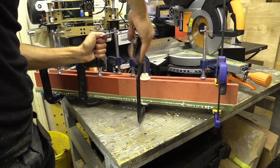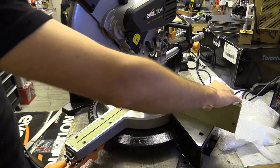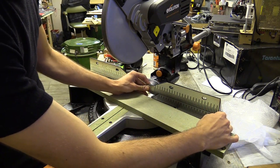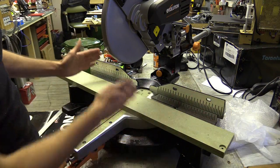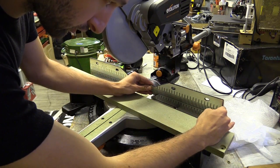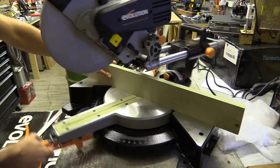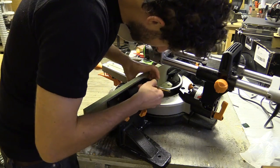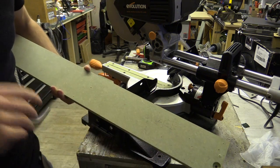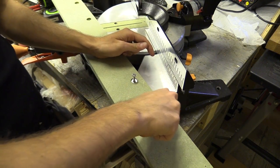Along with the zero clearance insert, the saw's saving grace is that you are not designed out of the object – the shapes are simple enough so you can make modifications and help the saw evolve. I'm going to offset these a little bit so that after I've made the initial cut I can keep bringing them forward if I need a clean edge. I've trimmed off the glue that squeezed out and marked the holes on the metal fence against the MDF. I'll drill those out and countersink the surface. The washer goes in like that and the machine screw like this.